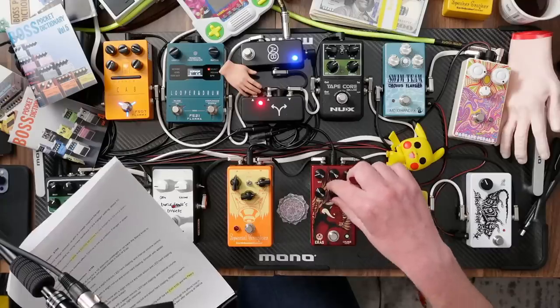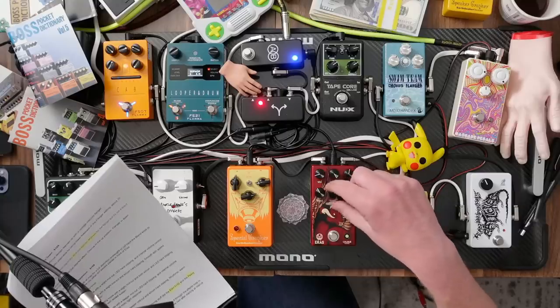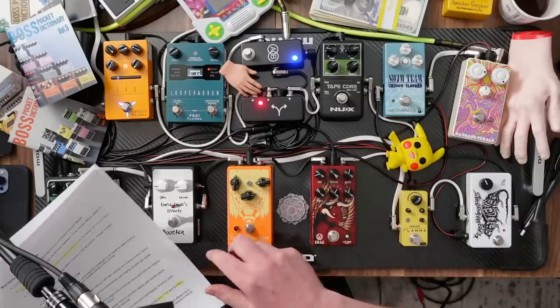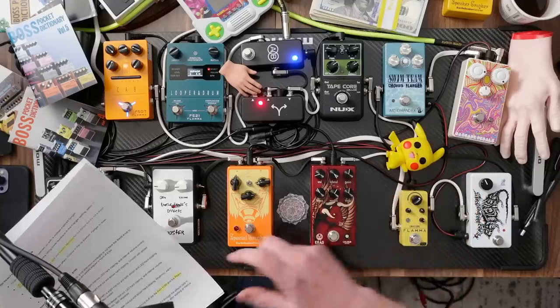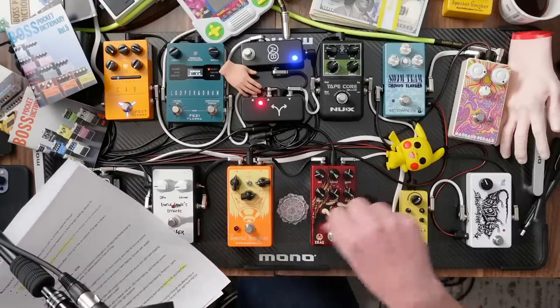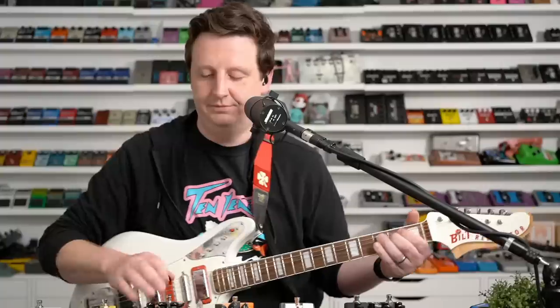Number four, rhythm mode has a deeper mid-cut with the LED clipping, so scooped mids, tighter response. And then the fifth mode is a deeper mid-cut with silicon hard clipping. The inspiration for this is like a 5150, like an EVH or a PV6505. Their engineer, Eric, developed this. He loves running it through his effects loop in his PV. Whoa, that's cool.